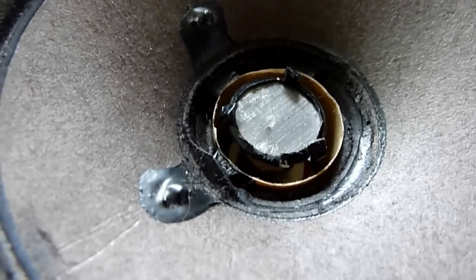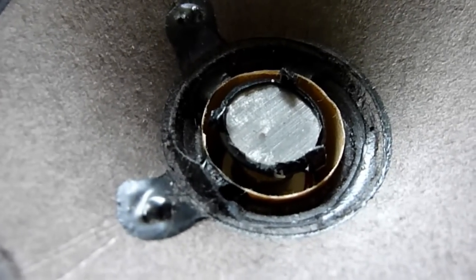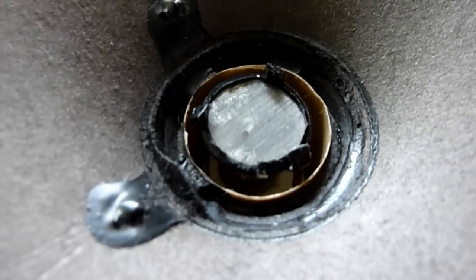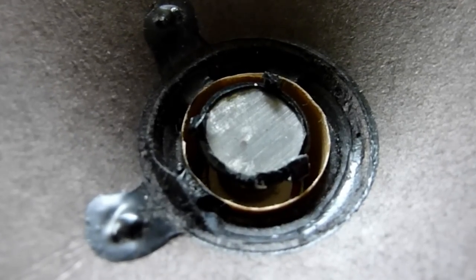In a way they sound really good because they go up really high, but there are a couple of problems. With piezo units at really high frequencies, the impedance drops down really low, to about one ohm or something, which is not good for your amplifier.